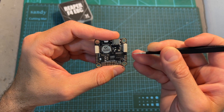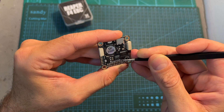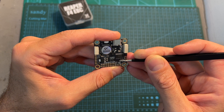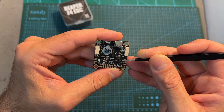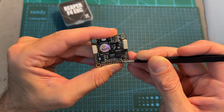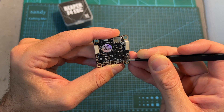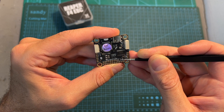As for installing and using this flight controller on a new build, first of all all the pads are labeled which is quite convenient. The supported voltage is between 6.5 to 30 volts so you can power it directly with up to 6S batteries. Out of the box, the camera is going to be provided with 5 volts and the VTX is going to be provided with 9 volts, but in case you'd like to, you can change the voltage of the VTX and camera by desoldering the center pad and bridging it with the right or left pad.